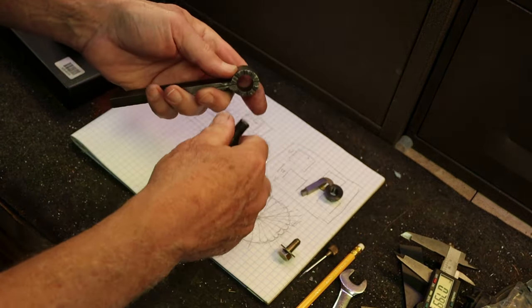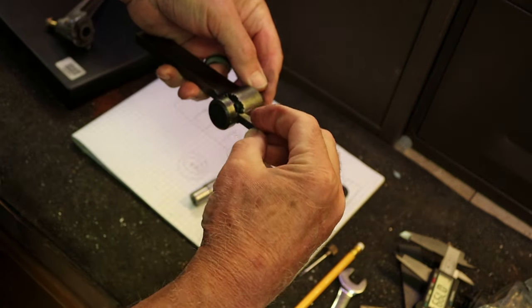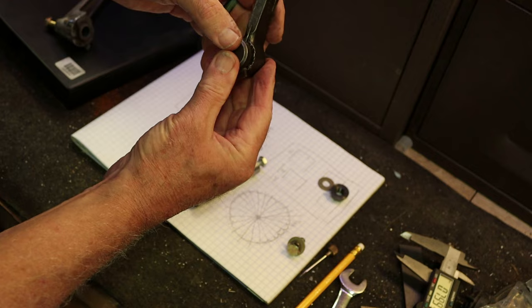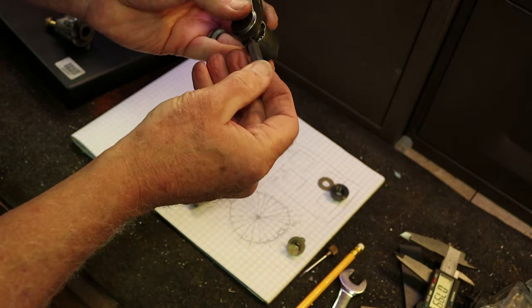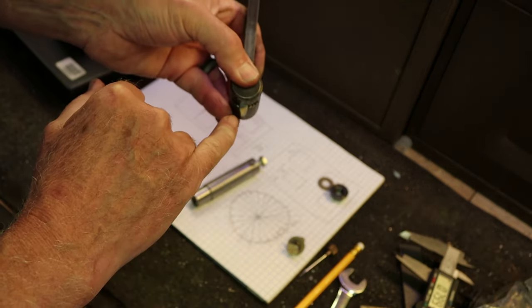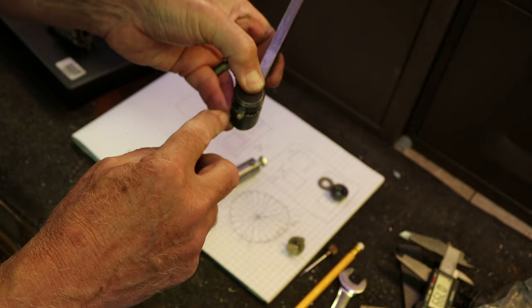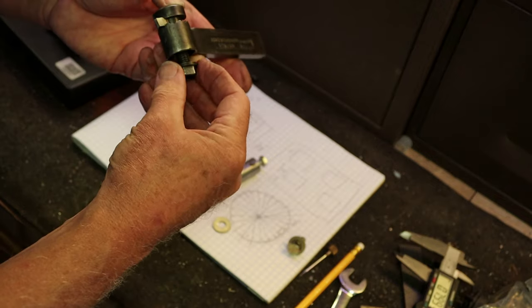and it's the normal tool holder for holding cutter bits in the shaper like this, so you can change the angle of the bit however you want. Here is actually a cutter used for cutting a gear, involute gear. So that's what that particular cutter was used for.